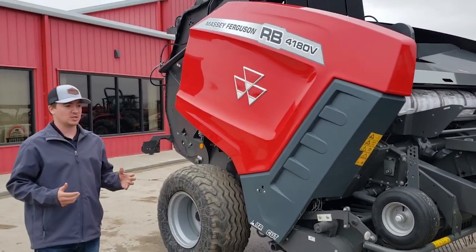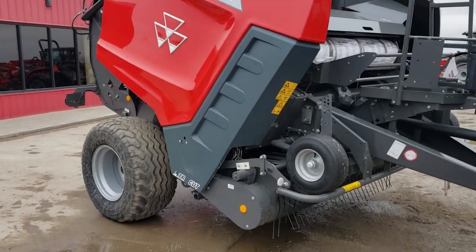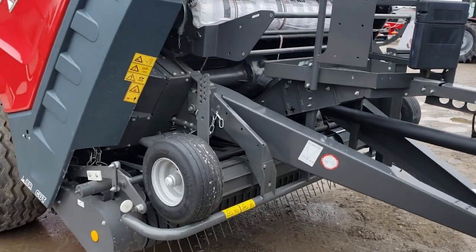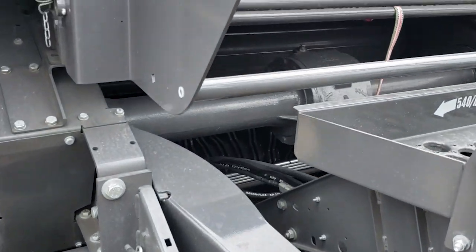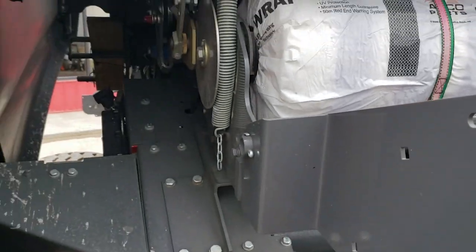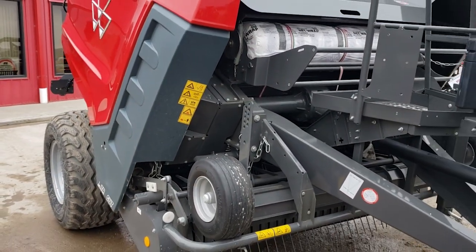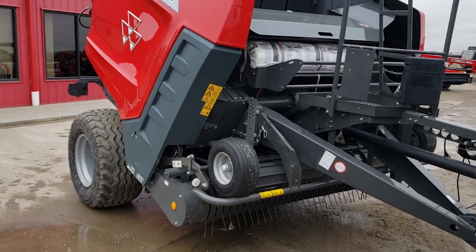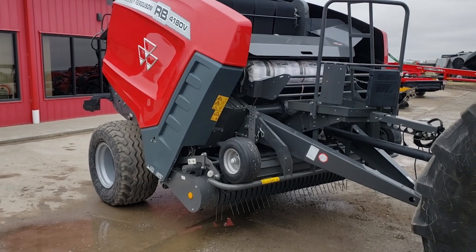which is honestly a little bit too much unless you have a high horsepower tractor to pick up those bales. But if you're going through the field at a pretty good rate, it's just going to be like your normal bale, about 1,600 to 2,000 pounds. So it's up to you on how big and heavy you want those bales to be. The more knives in there, the finer it's going to be cut. And if you cut that net wrap off, that bale's just going to fall apart.